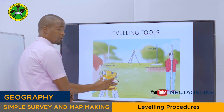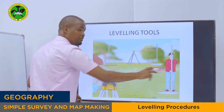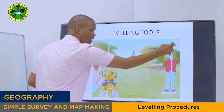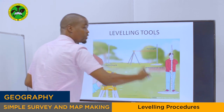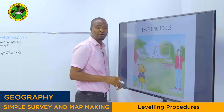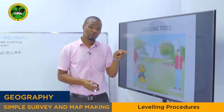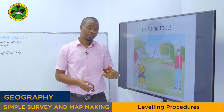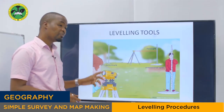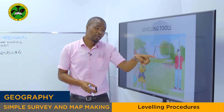So let's see what are the uses of these two main instruments. We normally use the theodolite or the spirit level to take the readings from the leveling staff. And then we use the leveling staff to give out the readings, so that they can be taken by the spirit level. So the usage of the leveling staff is to produce the readings, either the backsight or the foresight reading, while the usage of the spirit level is to read the readings to or from the leveling staff.